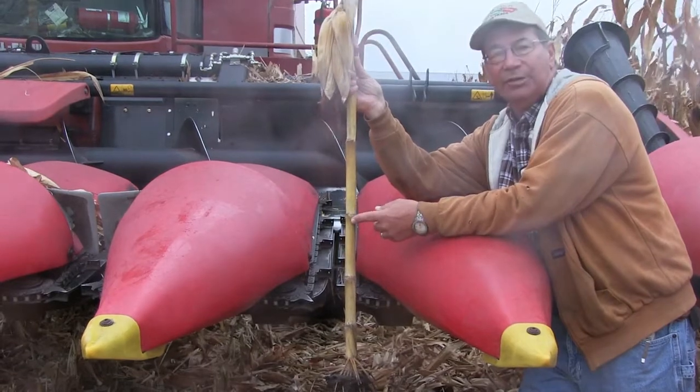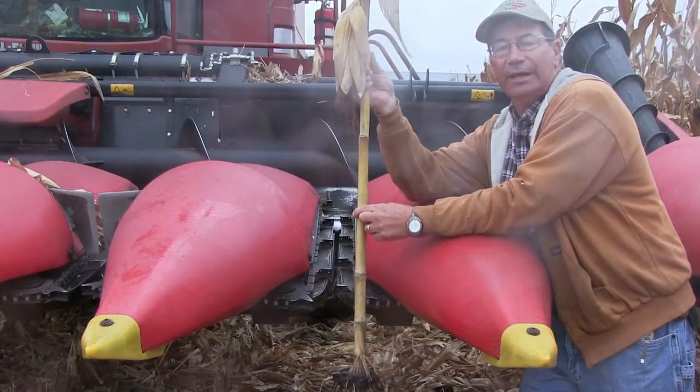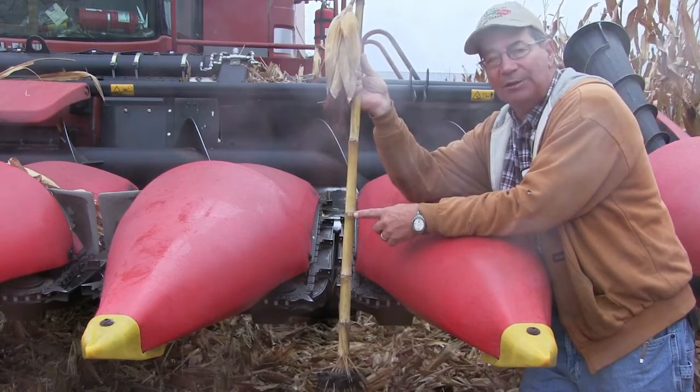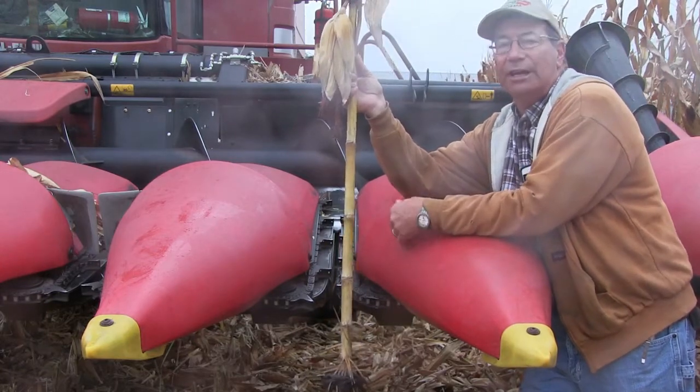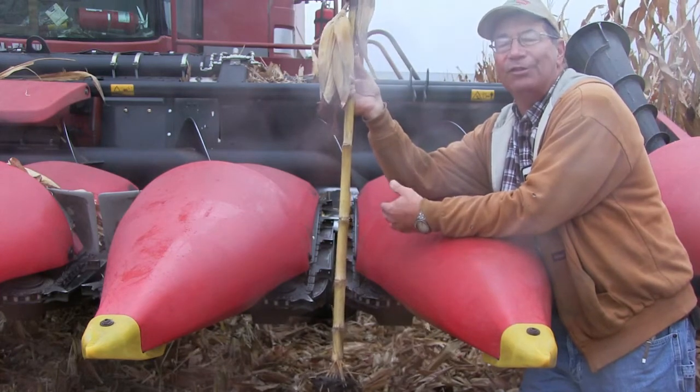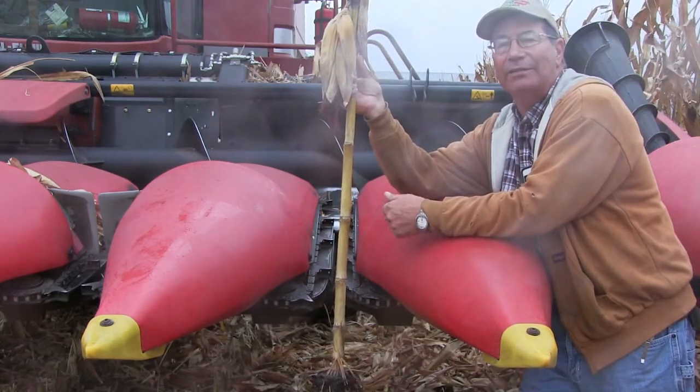This corn planted at 28,000 they're going to be kind of big. If you've got corn planted at 38,000 the nodes are going to be smaller. I have hydraulic adjustable stripper plates and it's very easy to open them up and get the corn head to work the way that it's supposed to.